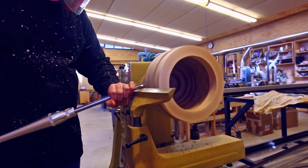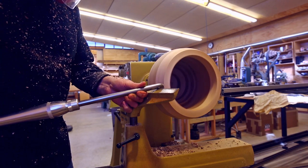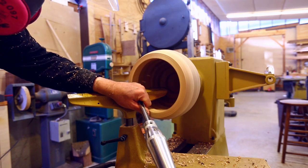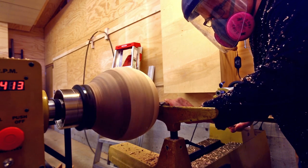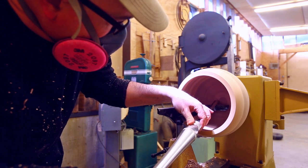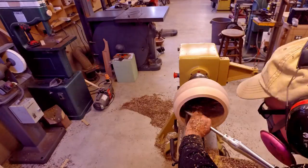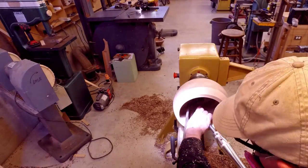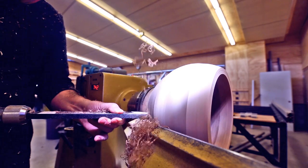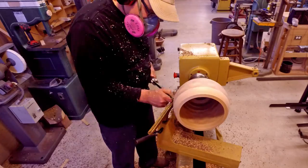I put it on the lathe and it was a little bit off center, but not too bad — actually better than I thought it was going to be. I started by shaping the outside and got that pretty close. I realized pretty quickly that it looked like a hot air balloon, which I thought was kind of funny. Then I got the rim straightened out and worked on the inside, cutting that pretty close. I did some scraping to get it smooth and closer to the final shape. It's really nice turning all side grain — it cuts really easily and leaves a nice surface.